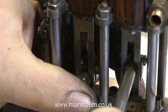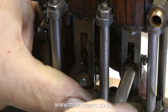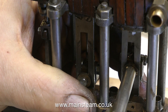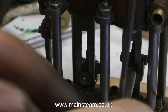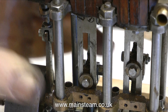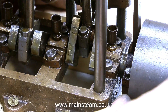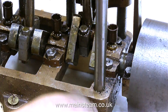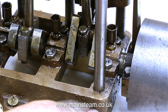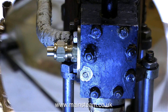These bolts are quite tight in the 5BA thread in the crosshead, which is a good thing — if they were slack they would fall out. I work on small steam engines frequently, so I've developed a feel for not stripping the bolts. A quick test run tells me that everything's okay. Time to have a quick look at the bottom end of the engine — there's quite a lot of play in the crankshaft. I might have to do something about this later, but for the moment I'm just going to leave it and get on with a lot of other work that needs to be done.